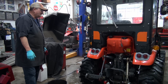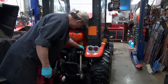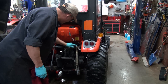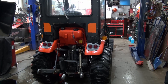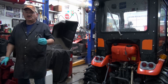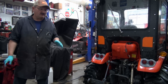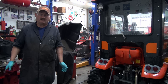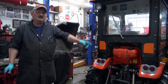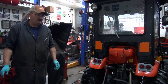They don't need an air filter. They've got something doctored up here — they ran into trouble with the fuel bowl, so they got a new fuel bowl and a regular filter put in for the fuel. I'm going to try to put that back the way it's supposed to be. It's got an issue in high range — it's only got two ranges, like the BX has got a high and a low. In low range it pulls really good, but in high range we can hardly make it back up over the hill. So I'm changing the fluids and I'm changing the HST filter.